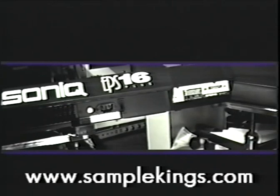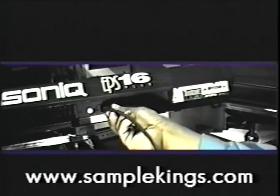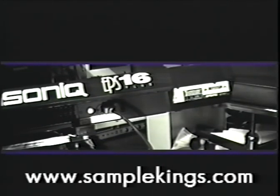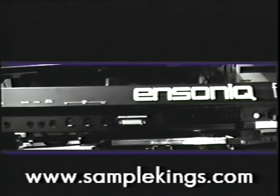Okay, as we look at the back of our unit and work from right to left, we have our power switch for turning our unit on. We have our power cord receptacle for plugging our unit in. And we have our fuse holder for changing fuses. Next to your fuse holder is the optional accessory port. This port is used for upgrading your EPS. Mine has over 2.5 megabytes of memory, plus it supports a SCSI hard disk, so I can save my samples without using floppies.